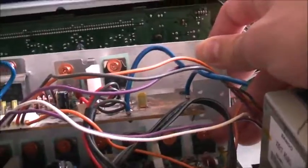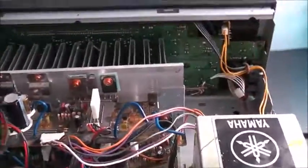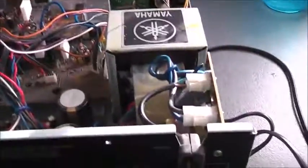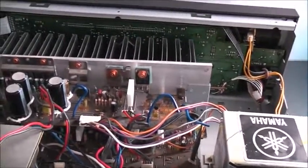There was a set of these transistors on eBay for quite cheaply, so I'm going to desolder them and pull them out of the circuit completely, then see if it behaves differently when I power this thing up. I'm pulling them out of the circuit and I'll test them individually and see what they're like.